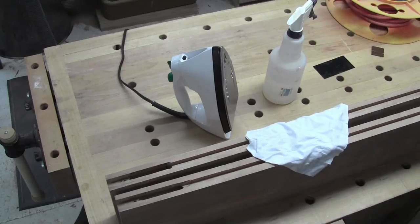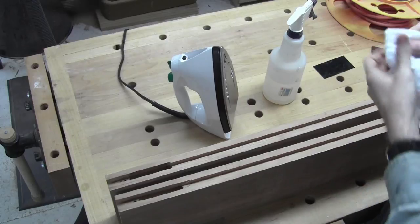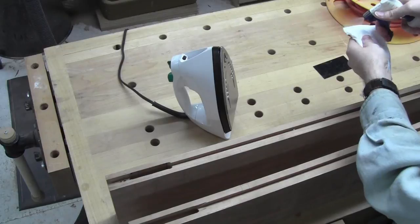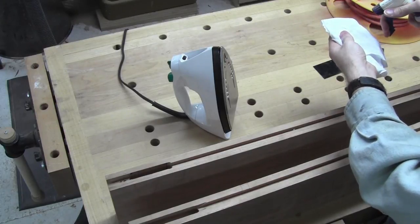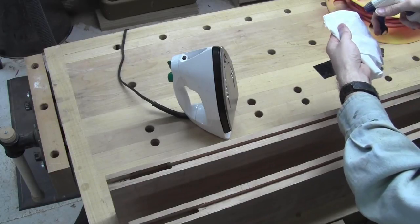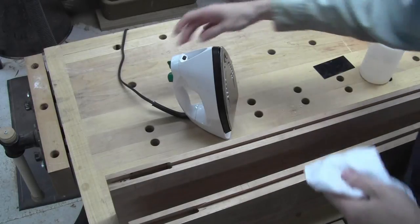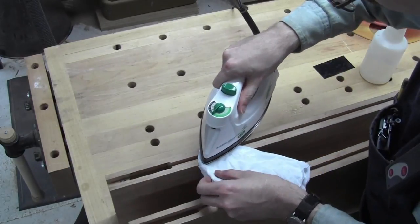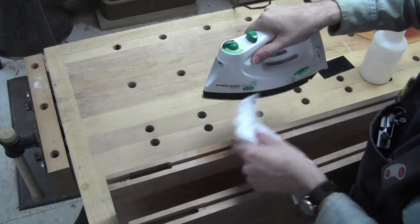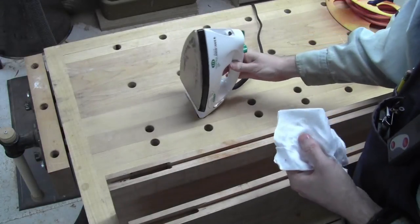All right, usual drill. Got the cloth, got the spray bottle, got an iron with some heat. There's a really good dent here. These ones aren't so bad. I'm going to do these first and just get things soaked. Takes a little bit for it to soak in. Okay. Just a little heat takes care of the job here, usually. And hopefully does not delaminate my glue.